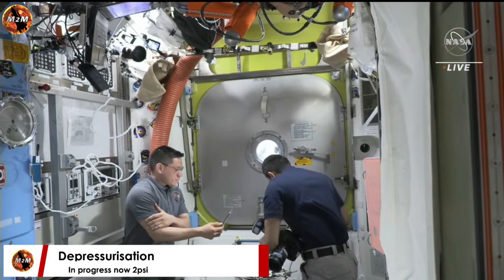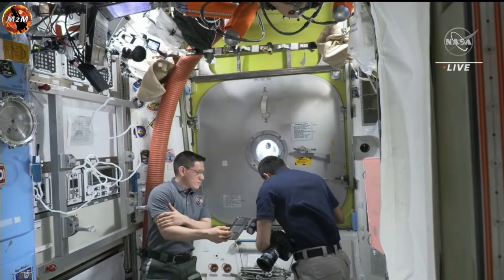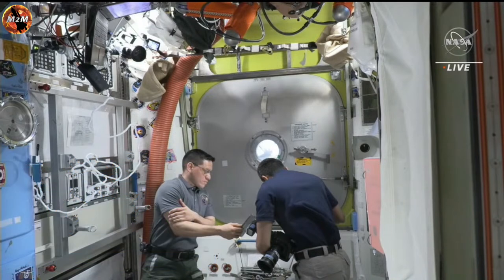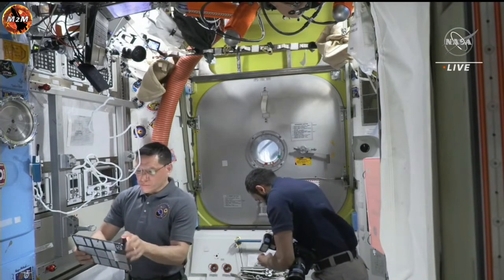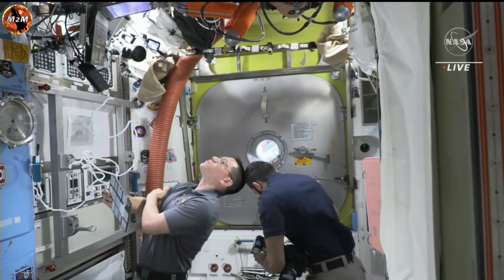Also on my left ring extender, I have my red hook. Gate closed, locked, block on block. My red reel and green reel are both unlocked. The red reel's yellow hook is gate closed, locked, block on block to my green reel. The green reel's small green hook is gate closed, locked on my red reel. And the green reel's anchor hook goes to Steve's right waist tether. Okay, so that anchor hook and Steve's waist tether large hook are both gate closed, locked, block on block.